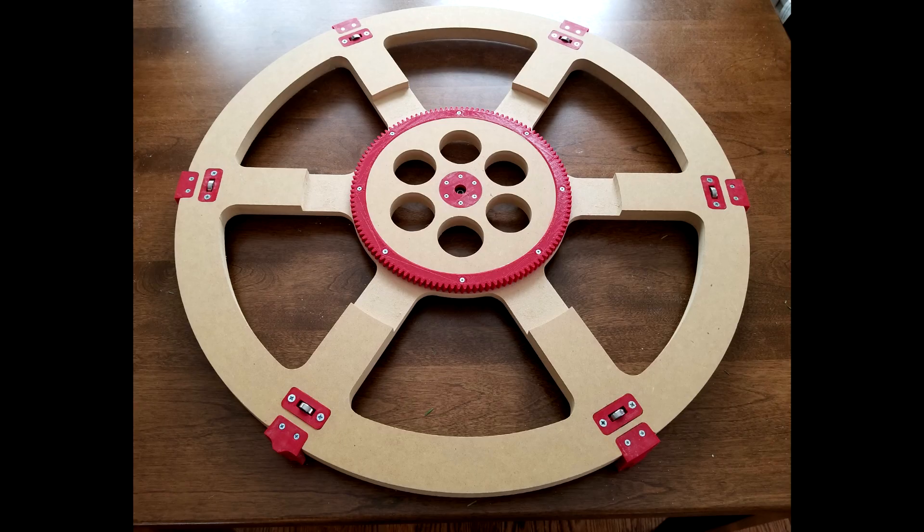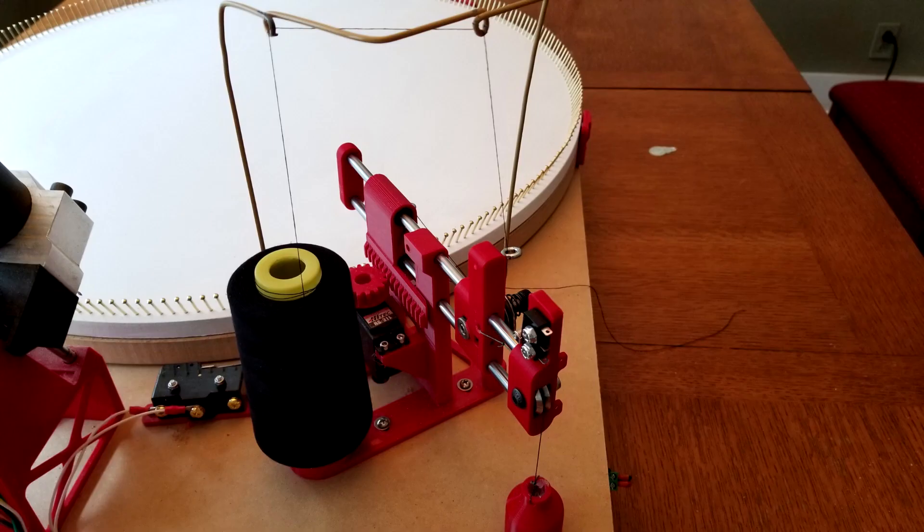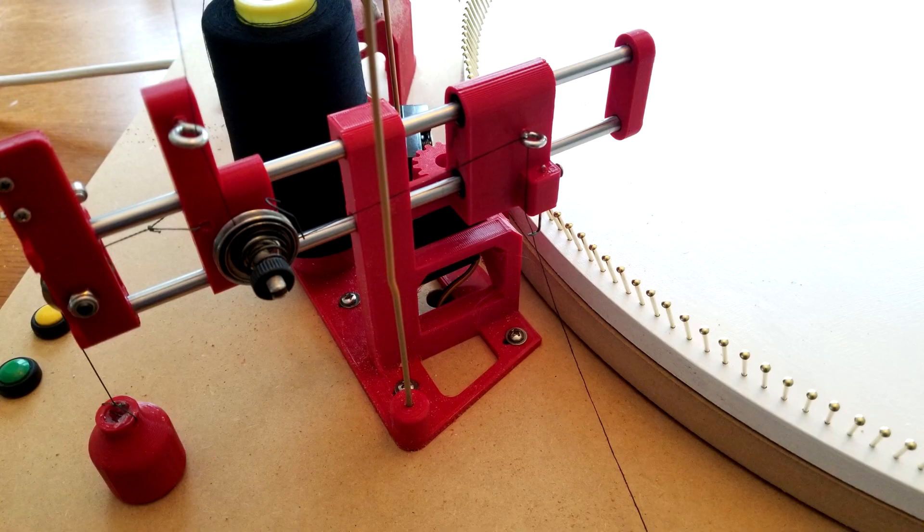The motor is nearly silent, but those bearings riding directly on the base make some noise — I would like to find some rubber wheels of a similar size. Around the perimeter are some clamps; one of them has a little index bump that aligns with a notch in the work piece, allowing the machine to find pin zero using a limit switch. The thread feeder assembly is designed to feed thread from a standard spool onto the nails. I use 6,000-yard overlock spools, which allow you to pull thread from the top without spinning the spool. The thread goes through wire guide loops to a sewing machine thread tensioner, then is guided to a heavy-duty sewing needle. The needle is bent to have the thread come out the bottom, preventing the spinning platter from ever wrapping the thread around the needle, and the sharp tip cannot contact the threads either.